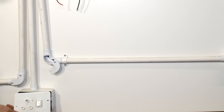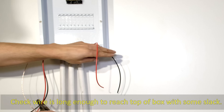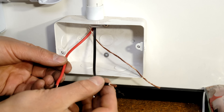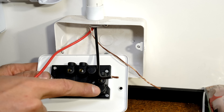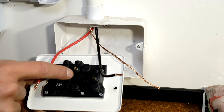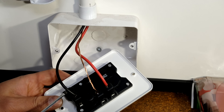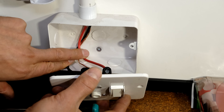Now I'm going to wire the plug circuit. I've got my plug and I'm using 2.5 millimeter cable — there's my live, there's my neutral, and my earth. I'm just going to tape them together and drop the wire down, then cut the cables. On the plug side I take the live and neutral and wire it into the plug. On the back of the plug there is a live terminal and a neutral terminal — connect the live wire to the live and the neutral to the neutral — and then wire the earth cable to the earth terminal in the middle. When you close the plug, bend the wires at the back so that they sit snugly against the back plate.